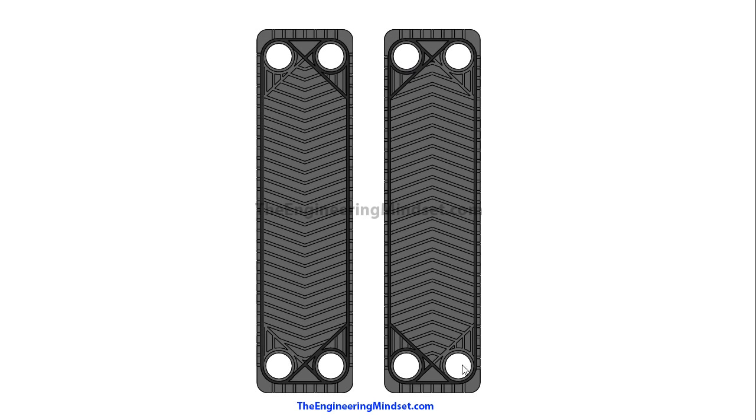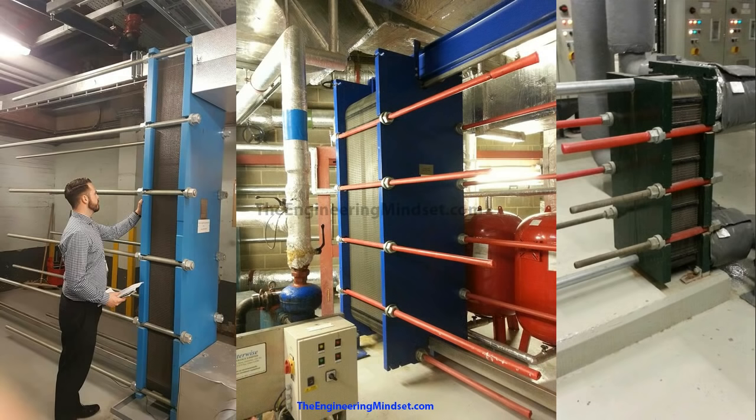Whereas here, there is no gasket, so the fluid could flow down and enter into this channel. Now the tightening bolts extend far past the heat exchanger — partly to fit all the plates during installation or maintenance, but also to give you the ability to extend the plate heat exchanger in future. This one is from a district heating network where the building is only half complete and they're expecting to double in size, so extra bolt length has been allowed so that plates can be added and the heat exchanger can grow with the demand.